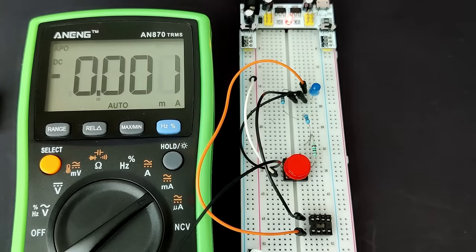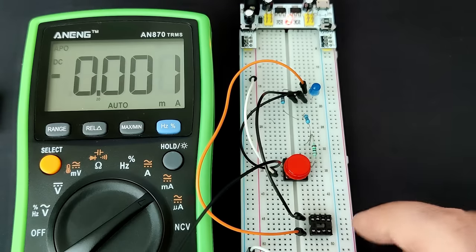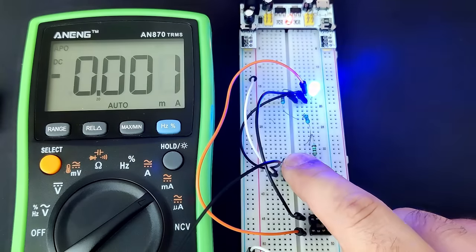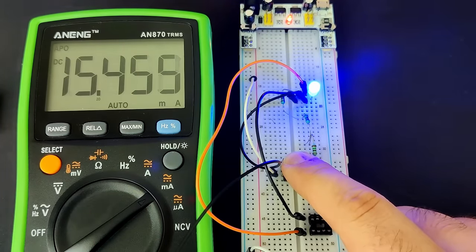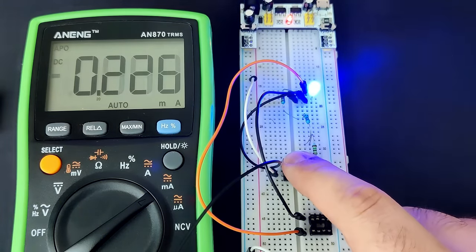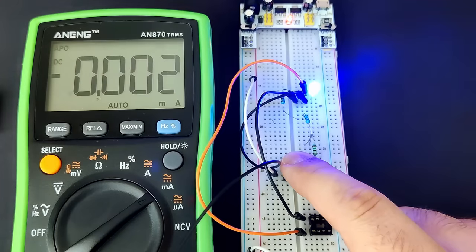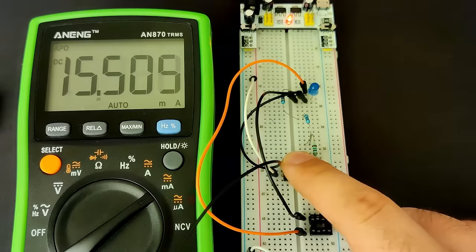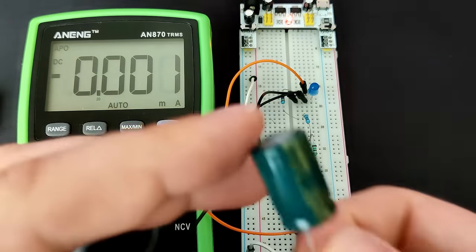So I decided to wire up a simple circuit to test the capacitors using a blue LED. There are a few resistors in series which add up to 125Ω. The blue LED requires a voltage of 2.5V. There is also a push button and an IC socket to connect the capacitors to the circuit. The circuit is powered by 5V, which is below the rated 6.3V of the capacitors. Without any capacitor in the circuit, the LED powers on when I press the push button and immediately switches off when I release it.